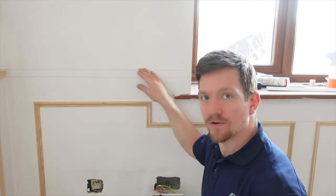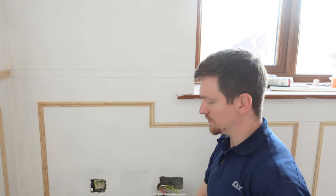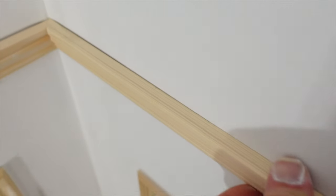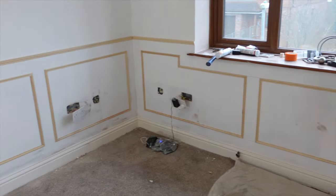This top section we've got to run through and stop it on the reveal — that's because we've got our shutter blinds in that spot, so we're going to finish it there. What I've got to do is cut a piece and it'll slot into place. You've got a nice clean mitre — I push it in, it meets nicely in the edge, and I'm going to finish it nicely there. And that is how we finish that top edge. It runs all the way around. The next part is the exciting bit — I've got to start filling and painting, but that is for another day. If you want to see another example of how to panel a wall — one we've already done, a bit easier but equally as effective — click that video. If you like this video, please hit the like and subscribe button, cheers.